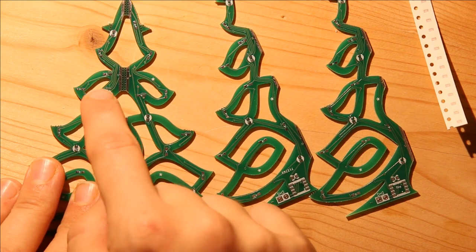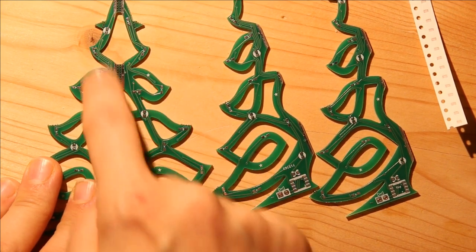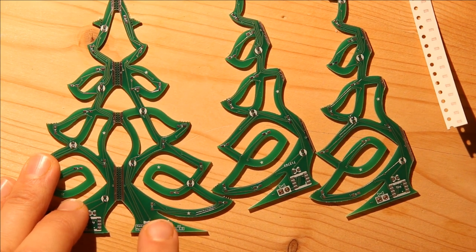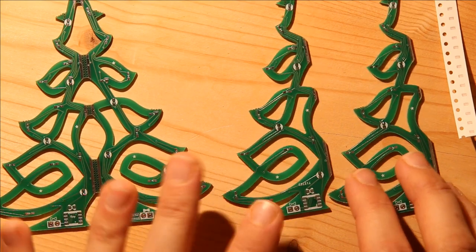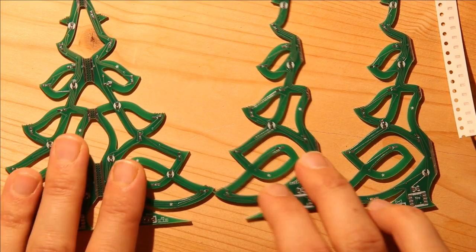If you do go ahead and add resistors on these, you're going to have both of these resistors connect from the positive side of your power supply to the negative side of your power supply. And that will either reduce how long your batteries last or increase the amount of energy that a USB power supply needs to consume. You wouldn't really notice that it's a problem just by looking at it, but you can check it with a multimeter.